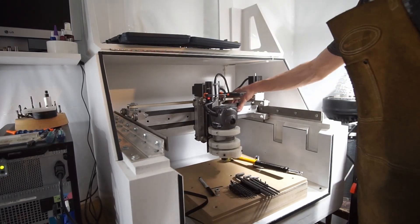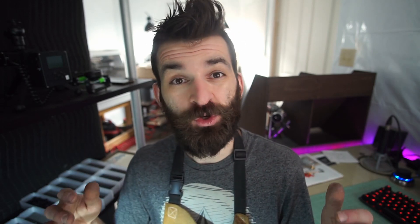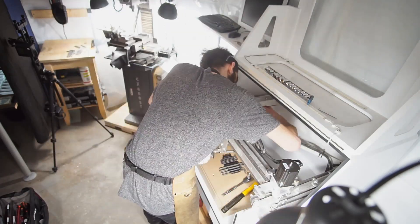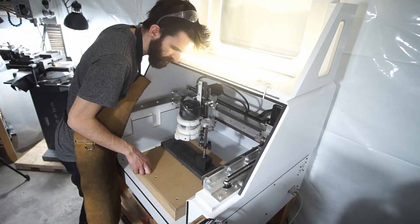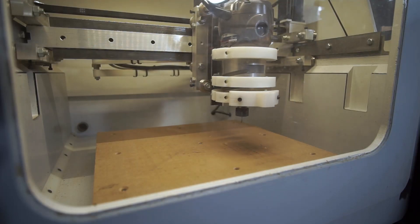The last thing is changing the belting and pulleys on the CNC router. When I first built it I used XL belting, which is totally workable, but I could measure the belt pitch showing up in some cuts — likely from the relationship between the pulleys and belt meshing together. Going with a finer belt might gain some resolution and reduce resonance and sound issues. Backlash didn't change much — it's still a belt-driven router — but it did significantly quiet down the two noisy axes, the X and Y. The Z has always had great performance and is difficult to get to, so I haven't changed it. The X and Y seem quieter, so I'm going to try some fancier finishing cuts later this week.